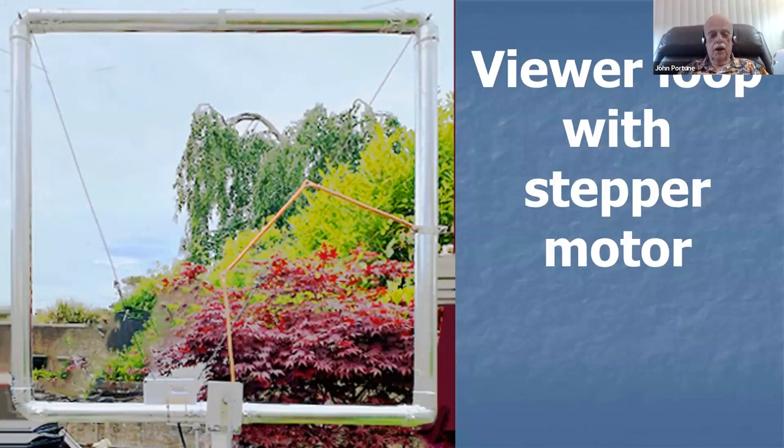He put a little box down at the bottom with a stepper motor in it and put a pull cord down from the little pull pipe at the top and just pulled the pipe with a pull cord and a stepper motor from the bottom and was able to fine tune the loop very easily with a stepper motor from the bottom. So there's lots of ways you can motorize there.